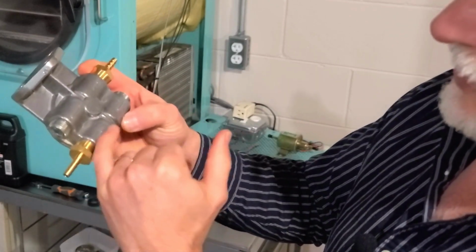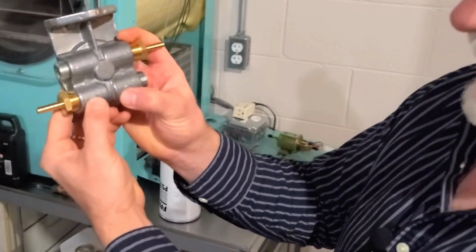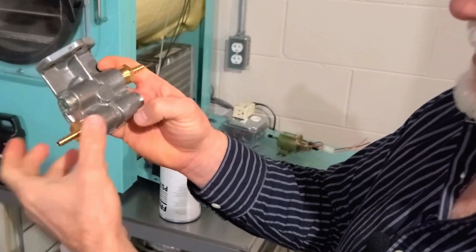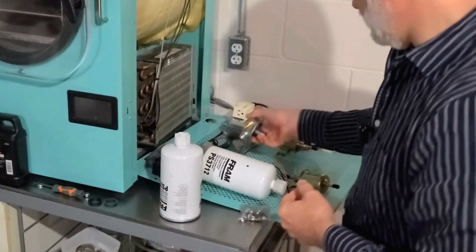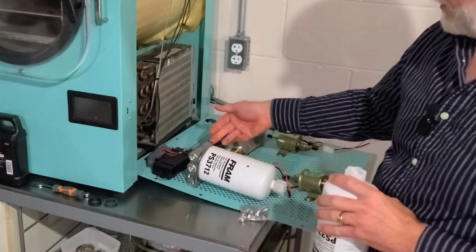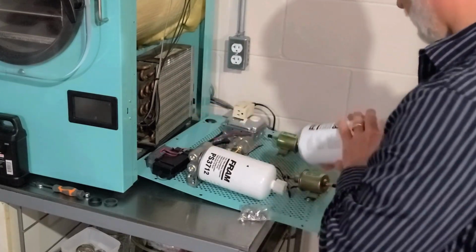But they have arrows, so both of these on this side, the bottom, are in. So oil comes in here, and then the clean oil will come out up here. So I want the oil to come in from the left, come out on the right on the second filter. The first filter is still on here, and I have the plug on both on the left, and I have the in and the out right next to each other up here on the top.